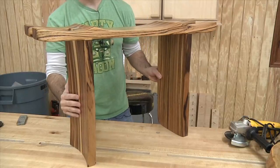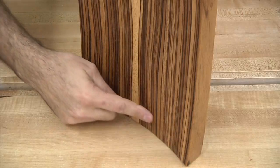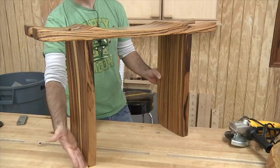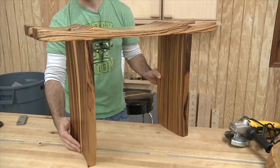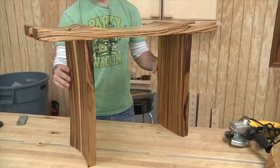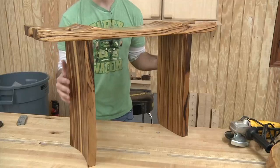This was all carved with power tools as opposed to being cut with a bandsaw. There is one curve here that cannot be cut with the bandsaw — this inside curve here. The leg not only has a curve cut this way, it also has a curve cut this way. So in that second dimension you can't really do that at the bandsaw, at least not any bandsaw that I have access to. So that does have to be scooped out with carving tools. Even though I could have done a lot of this with another tool, it was a great exercise and really helped me hone my skills.